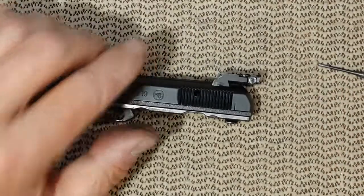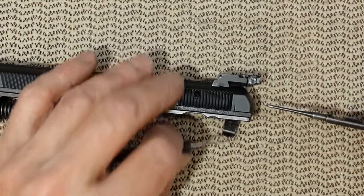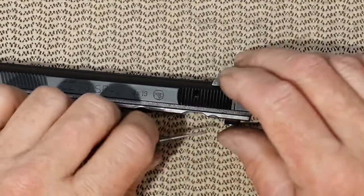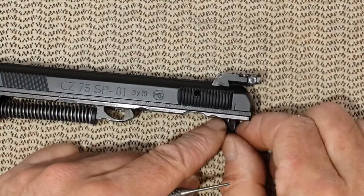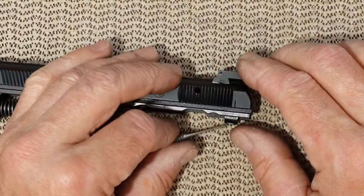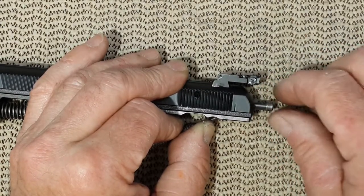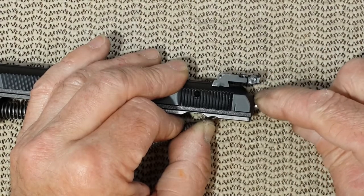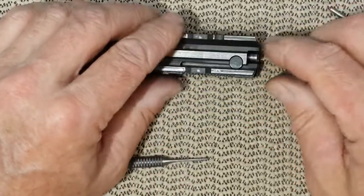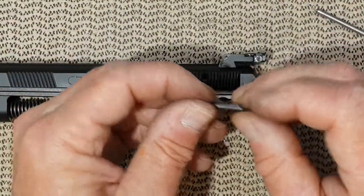You need some kind of punch to push the safety device all the way and you will be able to insert the firing pin. The firing pin has notches — you want them to face the top of the gun. If the pin cannot go in, the plunger has turned and the firing pin is hitting the plunger. Push the safety plunger in, insert the firing pin, push it in, release the firing pin a little bit, and the plunger should come out. We are in.